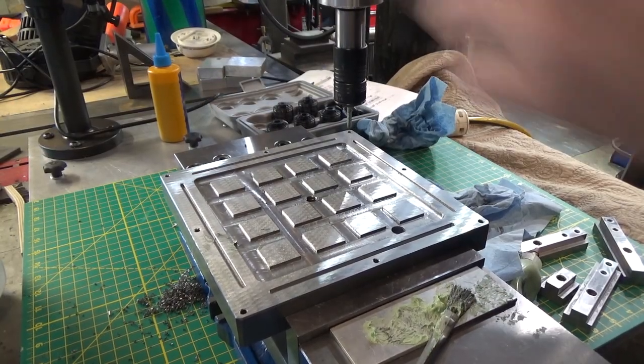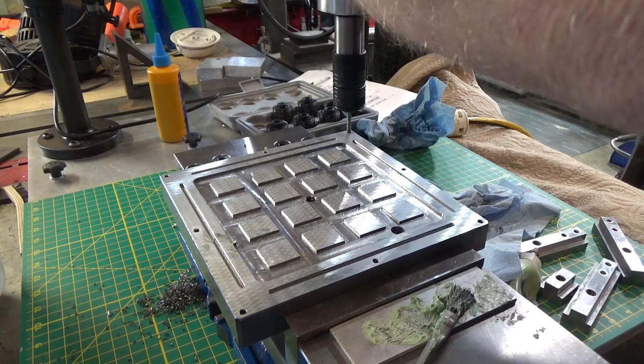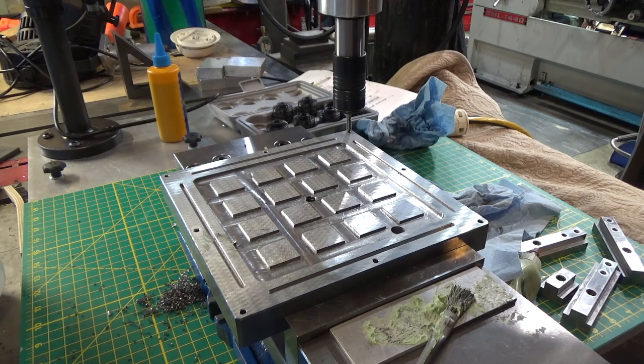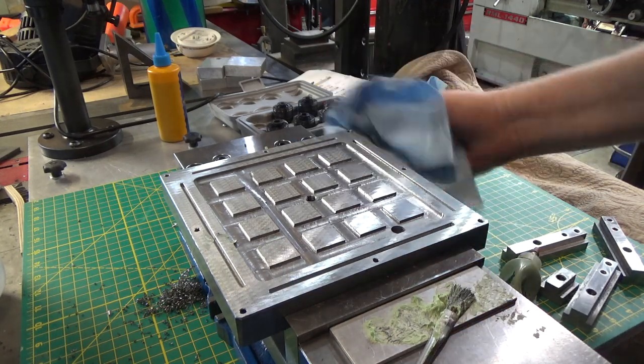Here are the ones that have me most nervous: 10-24 into steel. I am going to do this on auto going forward and back, even though these are all through holes so the chips can go through. This feels like I'm in the neighborhood of breaking a tap, but we're going to try it. That was the full length of tap — no problem! Had me nervous though. Wow, okay, that worked out well.